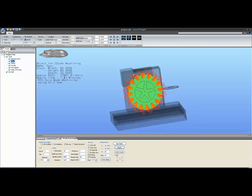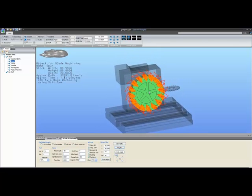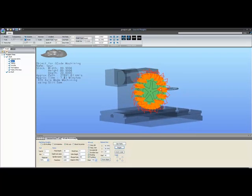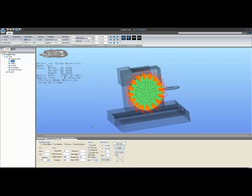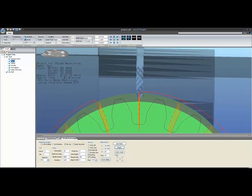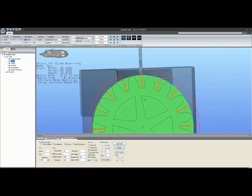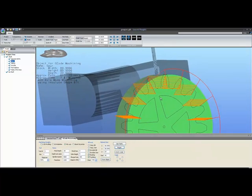Now another possibility you have, as we discussed in the introduction video, is that I do put out the tooth shape for every type of gear now. If you wanted to cut a fly cutter for a profile for that, you have two selections down below tangential saw. You have involute bit. This assumes that your bit is involute shaped, and I do not yet draw it as an involute. I probably will someday when I get time, but I don't want to waste development time on the little toys I'll do when we're all done.